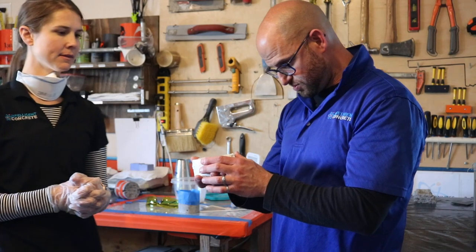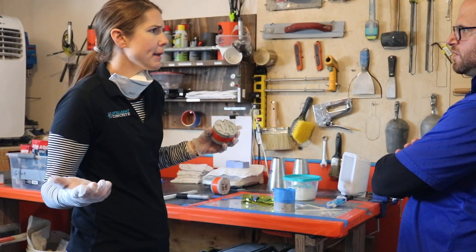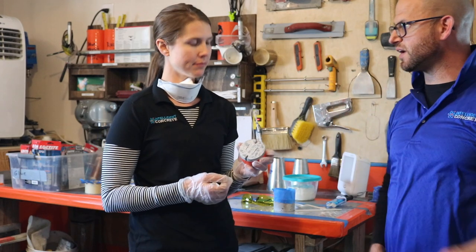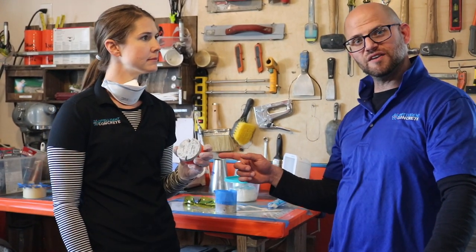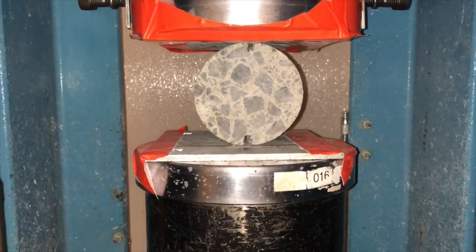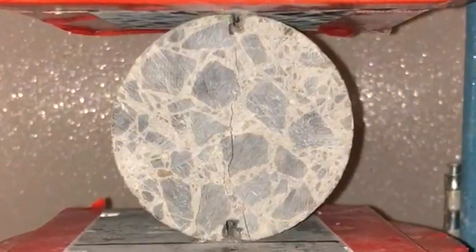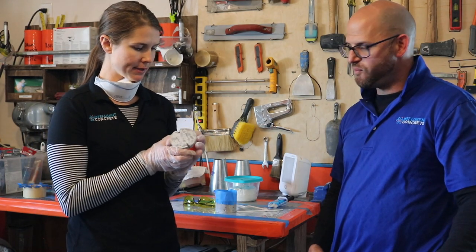We took eight samples, and I cut in a little bit to elongate the cracking path — to create a manufactured crack on either end. We slowly applied pressure until the crack happened. We've got live footage here: we applied a longitudinal compressive force on either side using steel plates at about four to six pounds per second until it cracked. Once we saw that crack pattern, we stopped the test. We got a beautiful crack and kept everything intact.